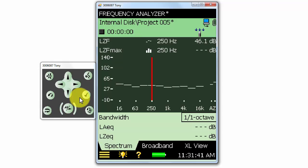The button at the top left is the manual event button. The manual event button can allow you to control signal recording or, with the logging applications, insert an event marker. It can also be used to take a picture with the 2270. The button below it is the back erase button. This allows you to erase the last 5 seconds of measurement data or to insert an exclude marker in the logging applications.